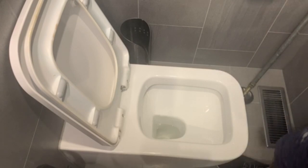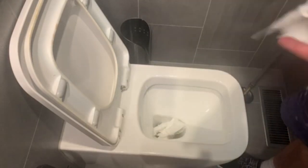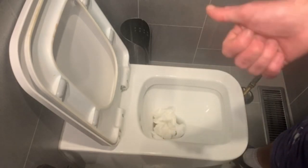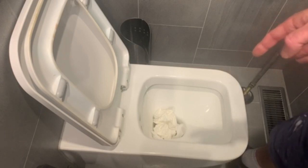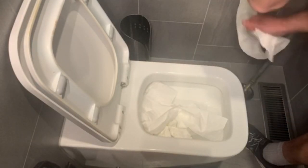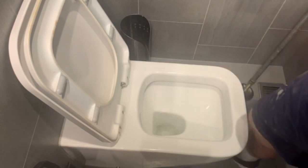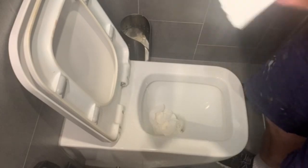For the toilet demonstration, I'll fill it up with an excessive amount of toilet paper to simulate a normal toilet paper blockage near the top. One very important thing: do not use paper towel, wet wipes, baby wipes, or even dissolvable wipes — they're all bad. The only things that should go into your toilet are toilet paper and whatever comes out of your body. This scenario is for when kids use too much toilet paper and suddenly you've got 15 people at the house with a blocked toilet.